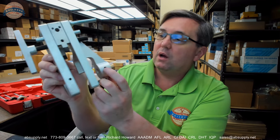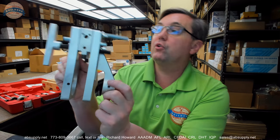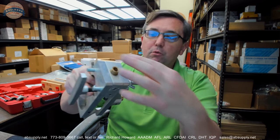And that Allen wrench obviously is going to help you with the setting of the drill fixture itself. There are certain areas on here. There's a set screw for your bushing, obviously. For your drill guide bushing, for your other two bushings, that set screw is going to be way down in there. Bushings are pretty normal to sell. I used to really make an effort to not wear out the bushings on anything, but eventually they will get a little large and it's time to replace them because your bit's moving a little bit, I suppose.